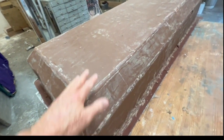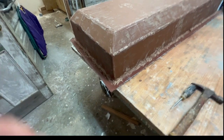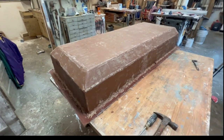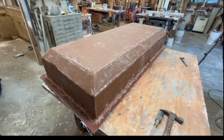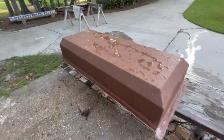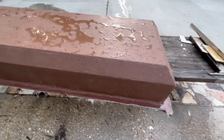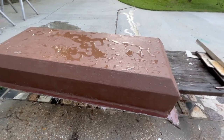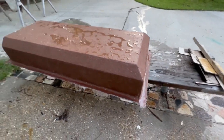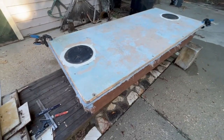Structurally it doesn't affect anything because it's only the paint that's not adhering to the glass. But before I do that I've got to get rid of all the oil-based clay, because nothing's going to stick to it. And to make it worse I sprayed it with a release agent which I think is silicone, so somehow I've got to clean it up real good before I sand it. Scrubbed it down with paint thinner and soap and water and got like 98% of the oil-based clay off. Now I'll flip it over, cut the edges — they're really sharp and I'm tired of bleeding — and get the rim cut to size and sanded smooth.